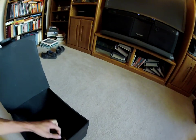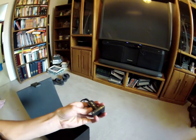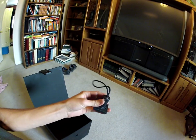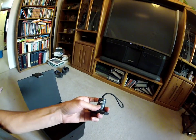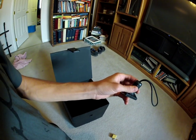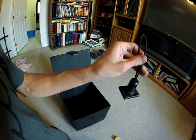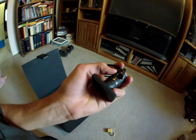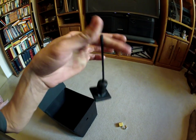As you can see, this is just a piece of metal bent at 90 degrees — this is the stop. It's a piece of cold rolled round stock. I drilled a hole in it this way, and then I drilled a hole in it this way, and then I got a piece of paracord, put it through, looped it, and then I melted it inside there so it would stay.